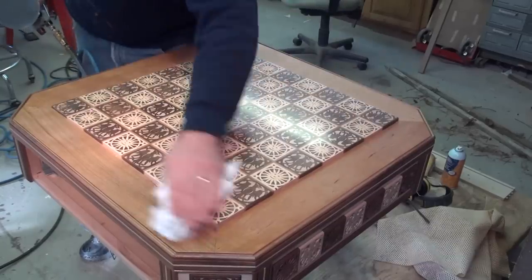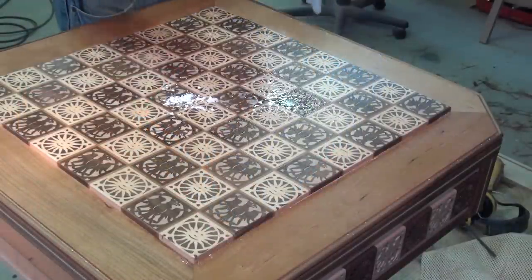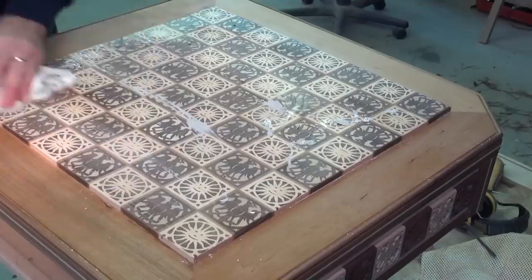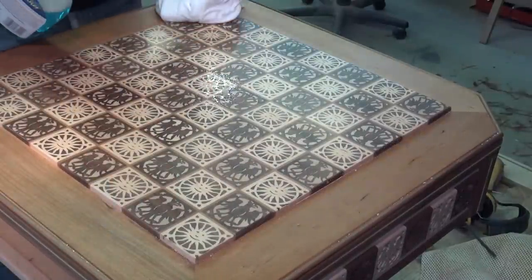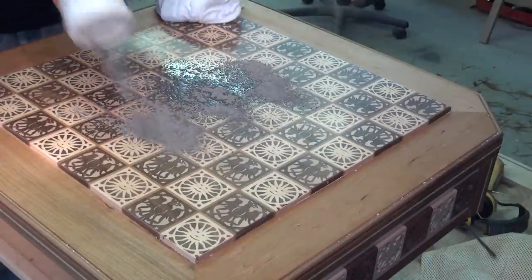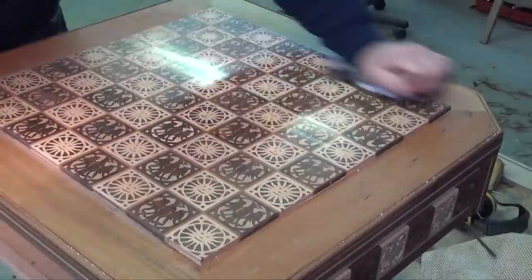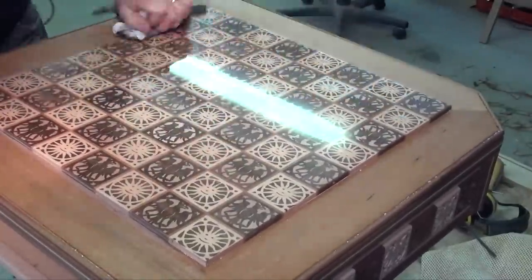You can see the shine I have so far. Now to take it to the next level, I use pumice stone mixed with the same soapy water solution to form a paste. And for the final step, I use rotten stone, making a paste and some hard rubbing. Watch the shine appear. Now that is just like glass.